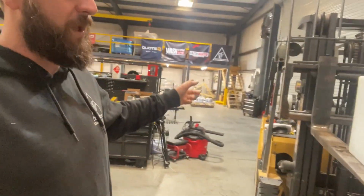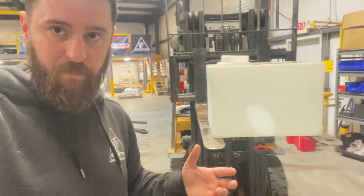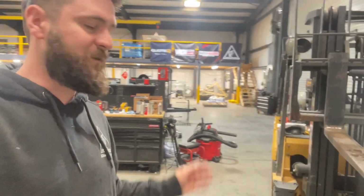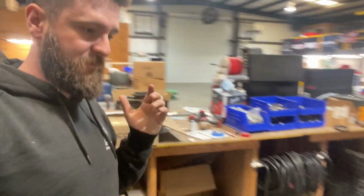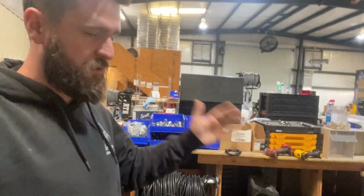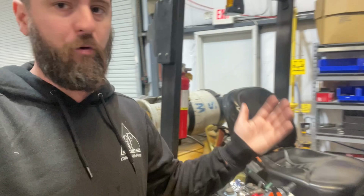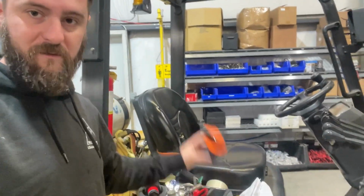Now, we do have a valve at a facility getting what's known as a CV performance test done, a flow coefficient value. So they're going to give us a chart with a little number on there, a third-party scientific controlled test, and that number equates to a standardized flow rate. So we already know that our valve is going to flow more than these other ones,